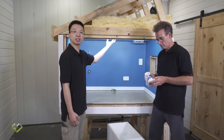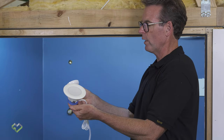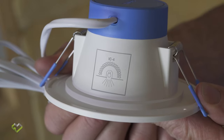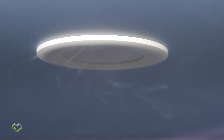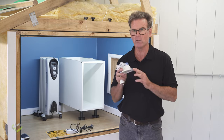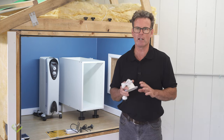When we talk about ceiling-mounted elements, commonly we see downlights or surface-mounted lights. Our typical downlight LED is going to be reasonably airtight — there's no airflow through LEDs because they don't generate the heat. If you want to be particular, you should be looking for IC4-rated downlights. They are safe to be covered by insulation as well, and the unit itself is airtight. It is always best practice that all downlights installed in a home are IC4-rated. They must be installed as per the manufacturer's instructions, which for IC4-rated recessed light fittings is usually to be abutted with insulation and covered.